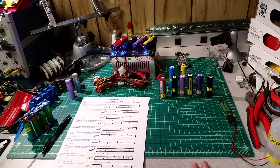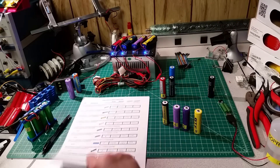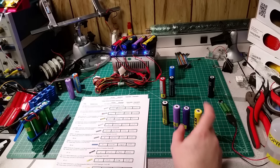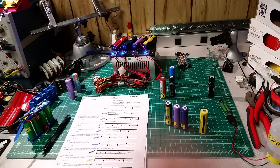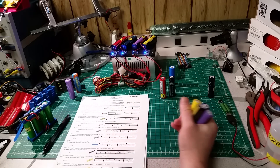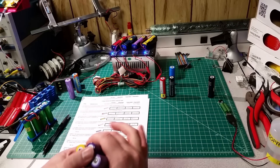Now let's move on to the really terrible performers. We've got quite a few that did not show any promise at all - a number of them in the 400 milliamp-hour range. These batteries are marketed as 4 amp-hour, 4,500, 4,900, and 9,800 milliamp-hour batteries. Some of our worst performers - not worth your money. 430 milliamp-hours, 400 milliamp-hours. I'm going to crack a couple of these open and see if we've in fact got lower-capacity batteries inside a steel tube. I had checked these all with a magnet to see if anything was obviously different - I couldn't tell any difference, so they all have a steel casing.